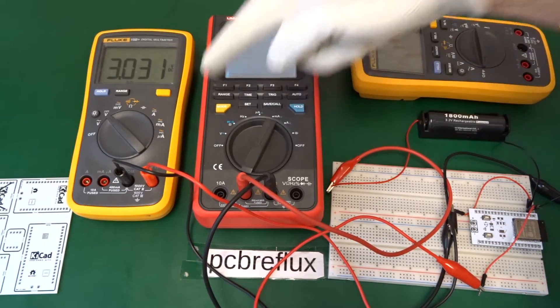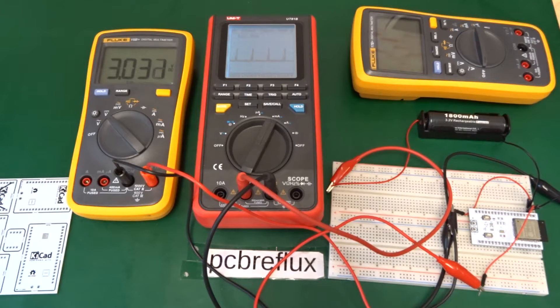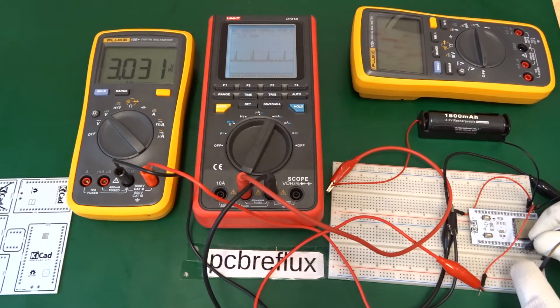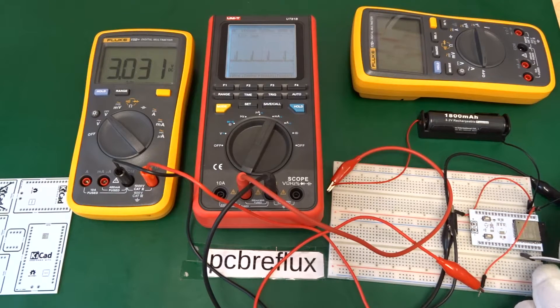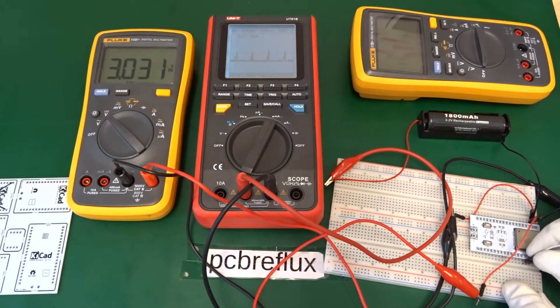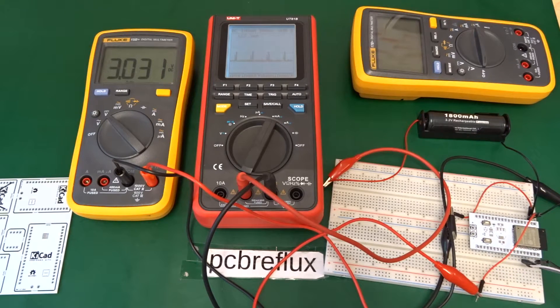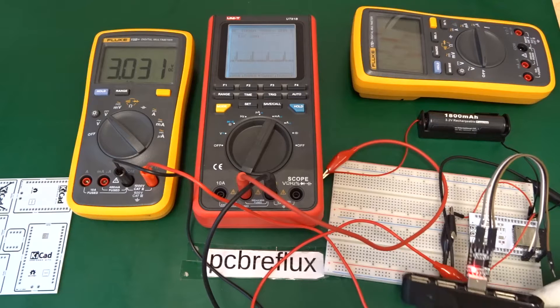Here we can see the MQTT firmware that I used in one of my last videos. We can see on the display the ampere spikes produced by the Wi-Fi connection. The average current consumption is about 122 milliampere, but the current spikes also factor into the estimation of our current consumption. I also insert the USB-to-UART converter powered by USB with its own power supply, and as you can see, it has no effect on the voltage or ampere meter readings — it's just for debugging and confirming the device starts up and produces the right output.